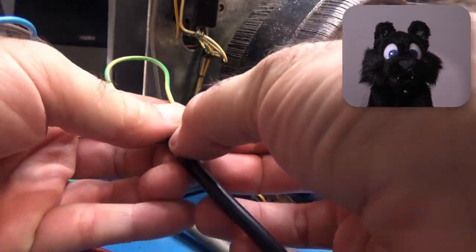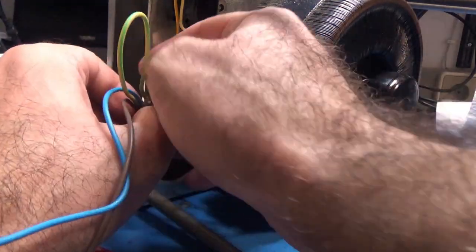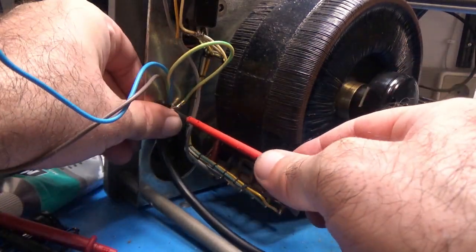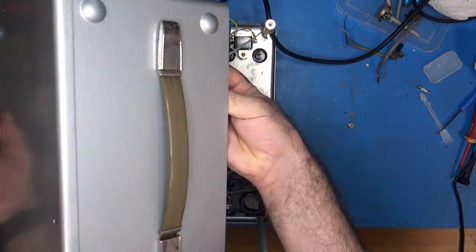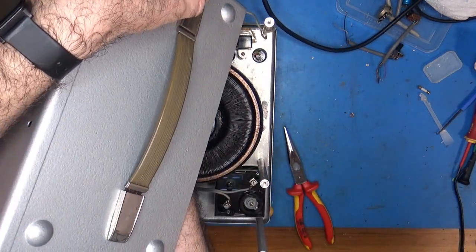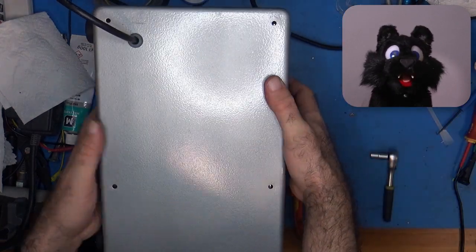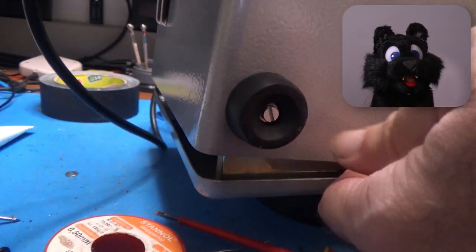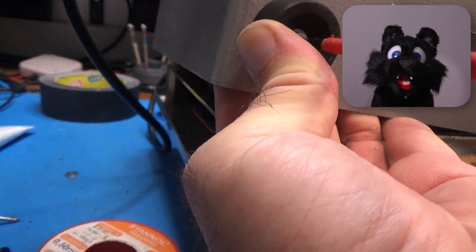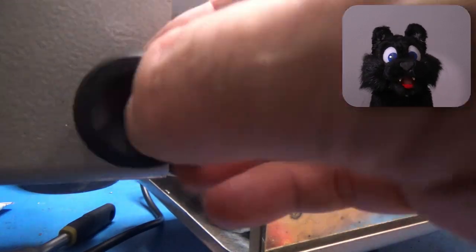And here comes the case. I had to solder the power cord again to pass it through on the back. I see that one of the rubber feet is exactly underneath the large inner frame, and that means my screw and nut replacement for the rivets doesn't fit. I just used a countersunk screw from the inside and put the nut on the outside for the offending one.